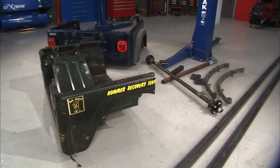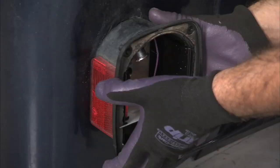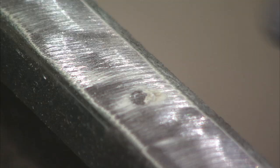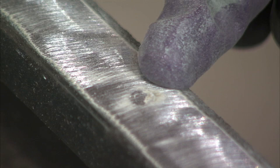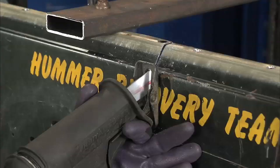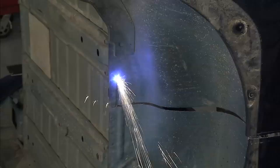We started with all of our materials laid out to do the job: two TJ tubs, just around 25 feet of steel to build the trailer frame, and our axle. Once we disassembled all of our lights, we were ready for some fabrication. The first thing we did was grind down the top rail of the tub so we could see the spot welds that connect the rail and tub together. We drilled out these spot welds, which allowed us to cut the tub and then put it back together so it looks like one piece when we're done. Then we cut the panels, using both a plasma cutter and a sawzall while making our cuts, taking our time so that everything was nice and straight. We cut off the corners on the blue tub so we could lay that tub into the gray one for added stability.